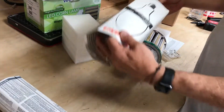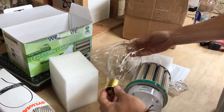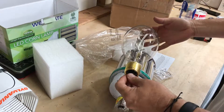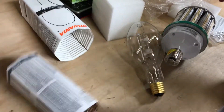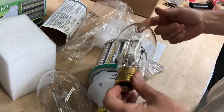One thing I wanted to show you is one of the metal halide lamps that this replaces. This is the 400-watt BT37 — this would be the biggest jacket. As you can see, it's pretty similar in size, but if it's really tight you want to give us a call and just make sure the dimensions will work for you. This is the smaller one, the ED28 MH400 — this replaces it also. You can see a huge difference in size.